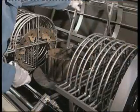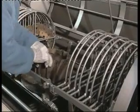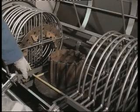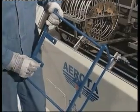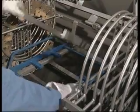Or if you have torque tubes which allow too much side-to-side movement, for example from the 757 or 737, then this frame is used. When a torque tube is without a flange, for example from the A320, this frame is used and bolted to the underside of the torque tube. Ensure the basket is secured with locking pins and no parts can fall out whilst in operation.